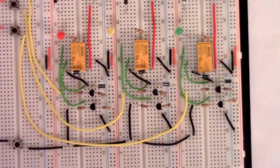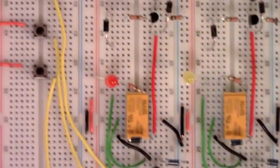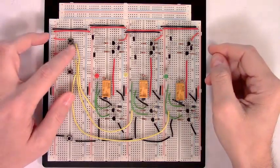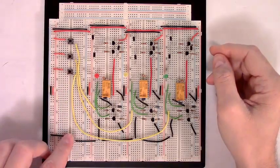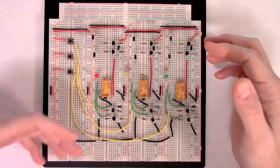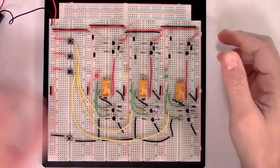I'm going to zoom in on all those latch wires. This is from momentary button C, momentary button B, momentary button A, and there's where they terminate to each of the buttons. At this stage we can do a test. What should happen is we should be able to push these buttons and each of the relay circuits should latch on and stay on. Then we can push the master reset and it will unlatch all of them, but there won't be any mutual exclusivity. Let's add our power supply back to the board — this test will let us know that our control lines are hooked up correctly.